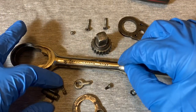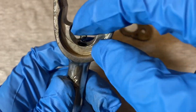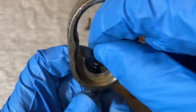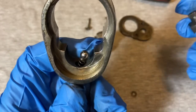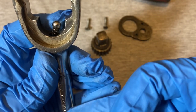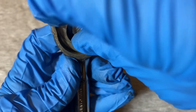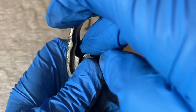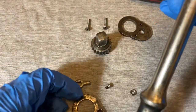Alright, to get this back together - it's kind of a roundabout way to do it. You put the spring there, and you get your ball detent - the ball from the spring rides on top of the spring and you balance it there, sort of like this. Okay, let's orient the pawl. We see that the teeth are up front here, so the back of the pawl is like this. Hopefully this will work - you just hold it down like that.